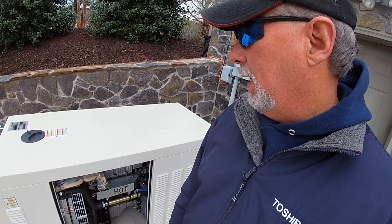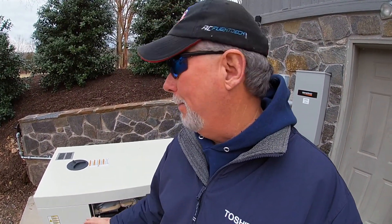Once they changed the diaphragm — swapped that orifice out and put the smaller one in — it runs and sounds like a sewing machine. It runs great. We are all up and running; it is now currently on standby and I'm very pleased with the final result. We have already done the load test on it quite a few times, but my wife is tired of having to reset the clocks, so I'm not going to put it through that again.